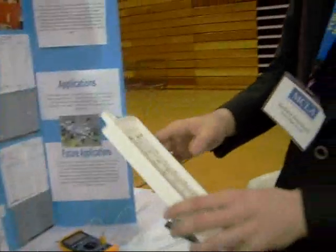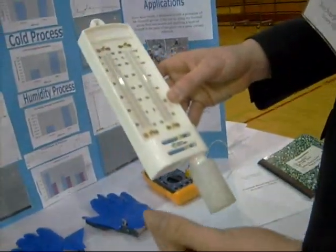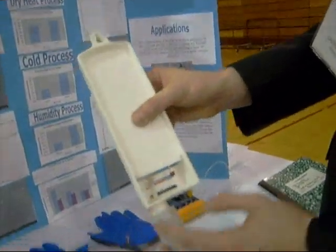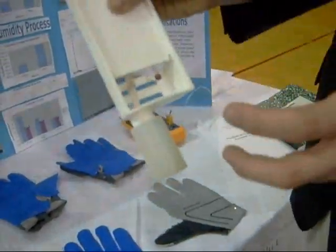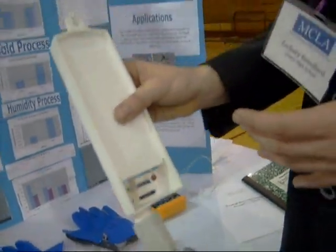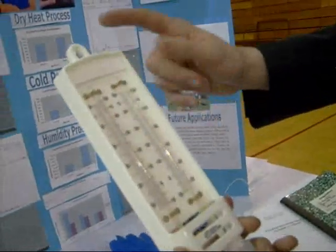To calculate relative humidity, I used the ratio between a wet bulb and a dry bulb thermometer. The wet bulb on the back has a wick that's wet with water. Water naturally wants to evaporate, but the more moisture in the air, the less room it has to evaporate and the closer the two readings are. I was shooting for about 80% relative humidity and ended up getting 100% each time — so that was great.